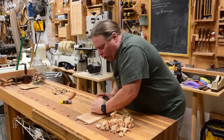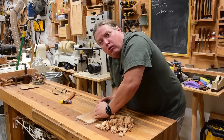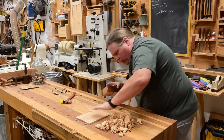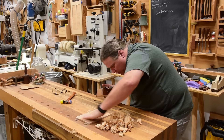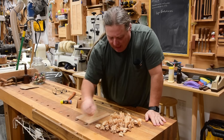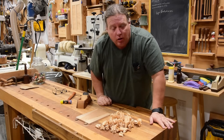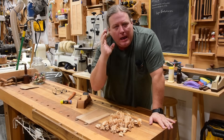This is not something that's unique to hand tool furniture making — I see the same tricks being used in the wood turning world, in the green carving world, all that kind of stuff. Once you are satisfied with the surface — I'm just getting rid of a few plane tracks I saw in the reflection — think about this: as much time as you spent at any one setting, I'm on my fine thin setting right here, you need to spend the same amount of time burnishing your work.